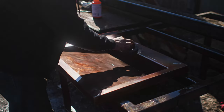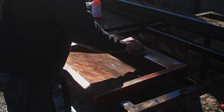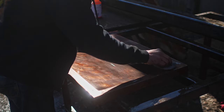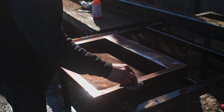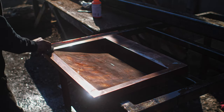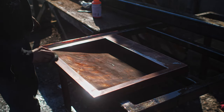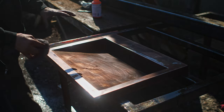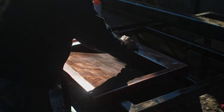Now I've found that while it's still wet, doing a light pass is good. I've got a fine steel wool here just to try to blend some of the anomalies out — just kind of transition things, diffuse it out. I'm not taking too much off. Also kind of highlighting the edges too, just to give it kind of an aged look. I find doing this wet diffuses it much nicer — it's a less scratchy, abrupt transition.